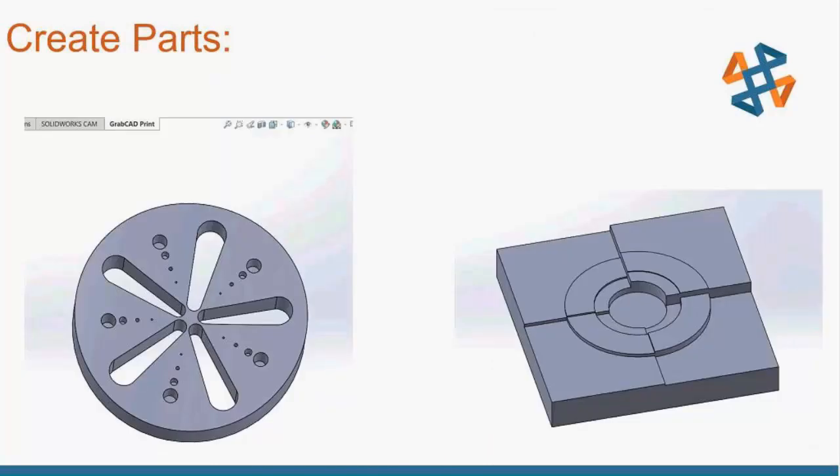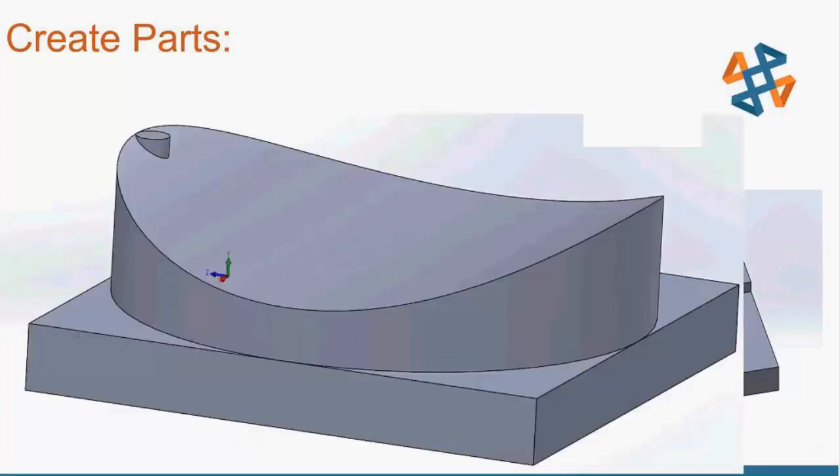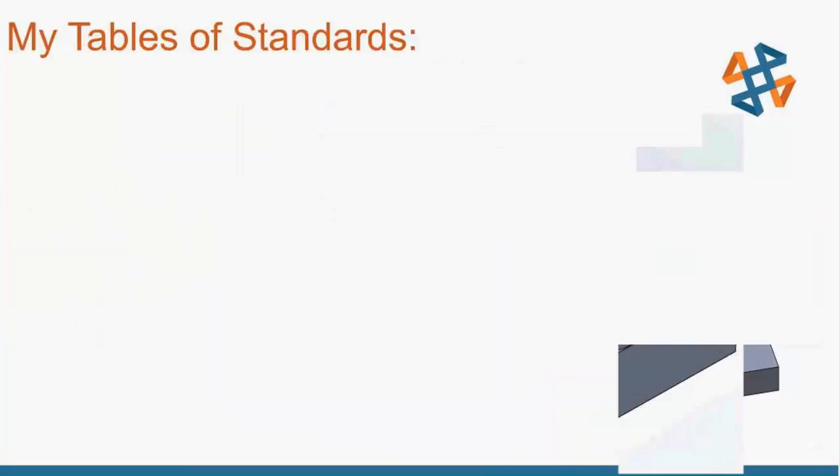When you're creating your part, you have to keep the geometries in mind. Simple flat surfaces are great. Curved surfaces look nice but will be harder to post-process. Holes and inlets will be really tough. One of the other tricks, if you're using the machine, is to build in a sacrificial tower or a Z touch-off point so you can zero your parts in the fixture a lot easier, especially on a curved surface. You have next to no place to get your highest Z with a 16th inch bit. It's just really hard to zero that way.